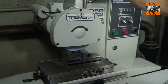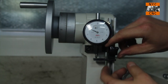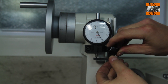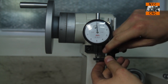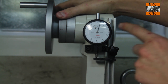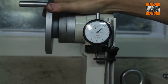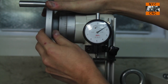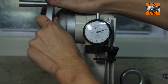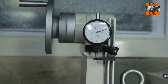Now we're not touching. Let me zoom in on the wheel and show you the indicator. We're close now, so we can preload our indicator. Instead of relying on the tick marks on the Z feed, we can rely on our indicator. This is a tenths indicator, so 1 is 1 thousandth, 2 is 2 thousandths, and the ticks in between are ten-thousandths. If we feed down — you can see — it's not crazy to think you could control a few tenths at a time. I don't want to feed too far down, so let's zoom back out and keep getting set up.